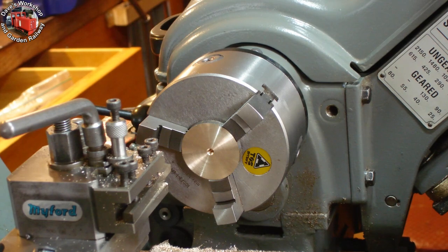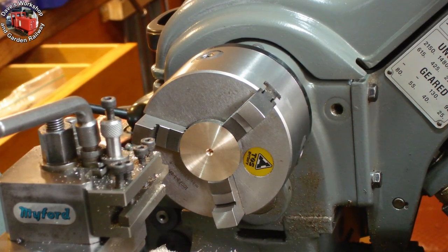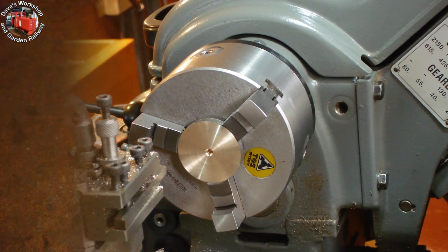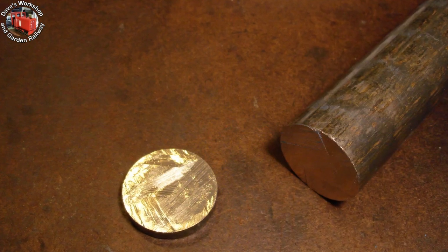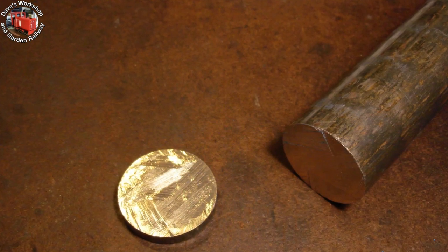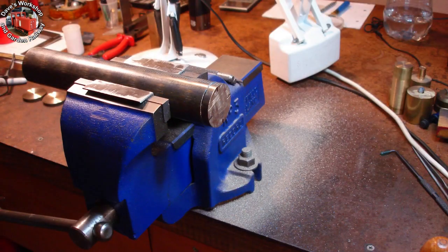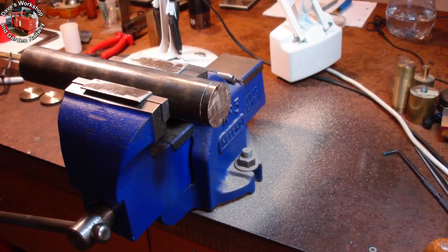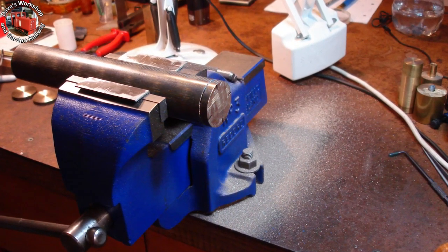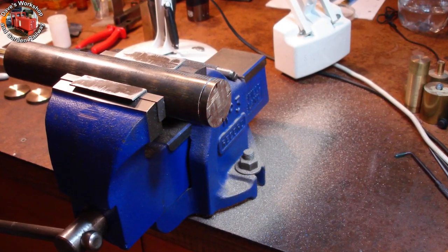Starting on the four new split eccentric straps. They are three-sixteenths wide discs of LG II gunmetal — I've had the material in stock since I made the steam diesel cylinder. Hand sawn from the stick. Dimensions so that it will clean up at 1.5 inch diameter; it's about 1.560 diameter unmachined. It was easy to saw with a 24 TPI all-hard blade. I cut around the periphery first and then cut down, indexing it 90 degrees. You can see the marker pen on the end.